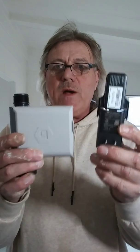Comes with a pressure gauge. Important that you put your system together properly and you space your sprinklers according to the pressure coming out of your pipe. Now, the pressure can vary from city to city, or if you have a well, then your pressure can really vary from other people's. So you want to make sure you take your pressure, and then you can measure how far your sprinklers are going to go.